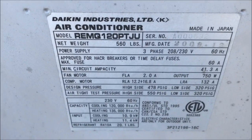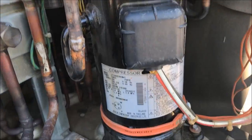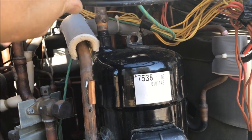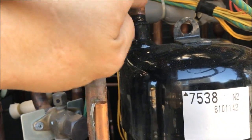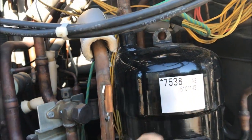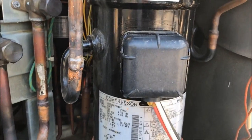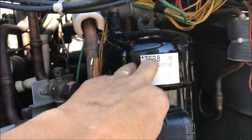That thing had nine lives, she just spent them all. Working today on replacing the master inverter compressor on a Daikin heat recovery unit — happens to be this bad boy right here. What happened is the indoor EEVs start sticking open and they start washing refrigerant back. You get liquid coming back and it washes out the top bearing and caused it to fail. Checked the compressor for meg ohms — everything is good. Checked the inverter board — everything is good. We've been losing them for the bearing.